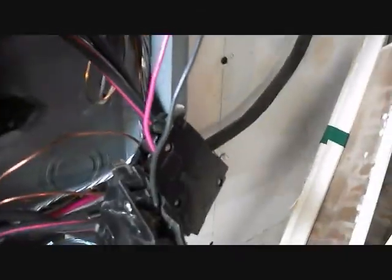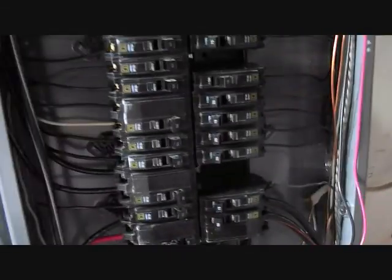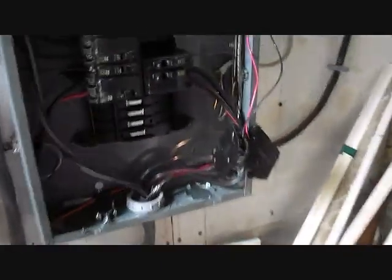And here they are. I've wired the ground over here and the neutral over there. And here's the two hots, the red and the black. So the black, I'll snap them in. All you do is just snap these in. I'll snap them in and then, gotta turn the camera off, we'll power them up with you watching. How about that? Okay, bye.